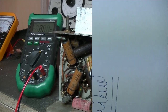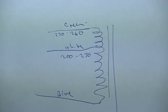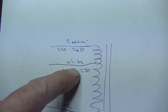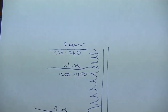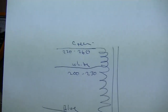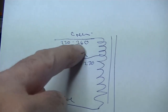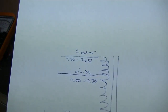I went to check out the schematic and here's what it showed me. Three wires - blue, white, and green - we don't have those. But common and the first tap gives us 200 to 230 volts, and the last one gives us 230 to 260. So I believe that 29 to 30 ohms is between the first two - common to 200-230. The 230 to 260 winding is the one I want and I don't have it.